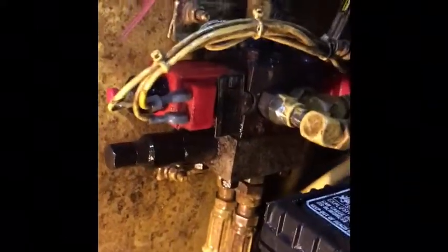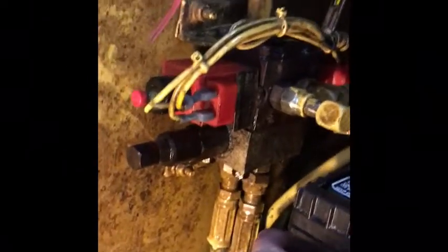I wasn't sure what this component underneath was, but I think it's a high-pressure bypass. There are two lines that feed into this thing. When I activate the function I can feel pressure in one line, but nothing seems to be happening in the other. That's because the only time you'd feel something in that line is if pressure got too high — hydraulic fluid would come in and flow right back to the tank.